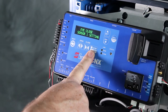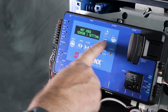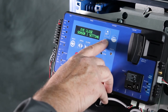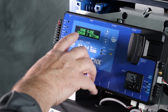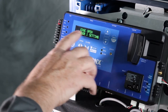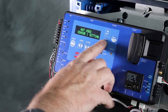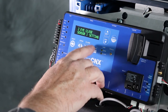Go select to get into here, and then with the arrow keys scroll through to see the different options. Option one is not used — that's what you would select if there was no sensor there. Option two is PhotoEye close, which is what we want. Option three is edge close, option four is PhotoEye open, option five is edge open, and option six is edge both — that's what you would use if you had a wraparound edge on a swing gate. To set it to type two, eye close, hit select.